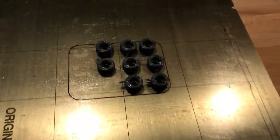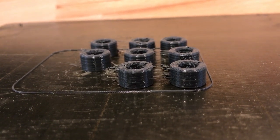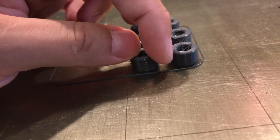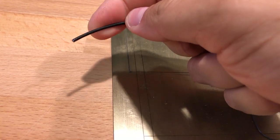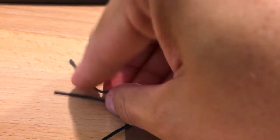I got the idea: instead of purchasing legs from a supplier we'll make them ourselves from flexible filament. I did some experiments yesterday with printing and it went quite well, but there are some problems. We have to disable retraction of the filament because when the printing head crosses the perimeters it cannot retract the flexible filament, so there are residues — oozing from the filament. This is normal filament — quite hard — and here is the flexible filament; you can see it's much more flexible. It has roughly the same hardness as this rubber.